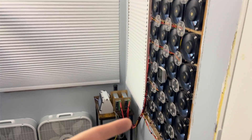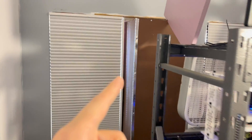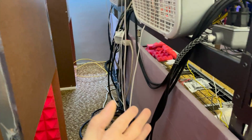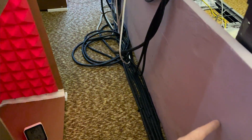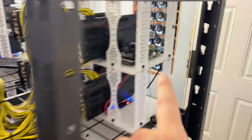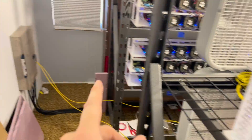This solved it fairly effectively. Now we have a fairly even temperature across here. In addition to that, this redirected the air down, and I have it crashing into this foam board right now. I just put these in last night, so they're not tuned — just roughed in — but it's working pretty well, so I wanted to show you. The air comes in and crashes into this, and it gets pushed up more or less, swirls around. And what this does is it allows this temperature controller to have control over the path length that the air takes.